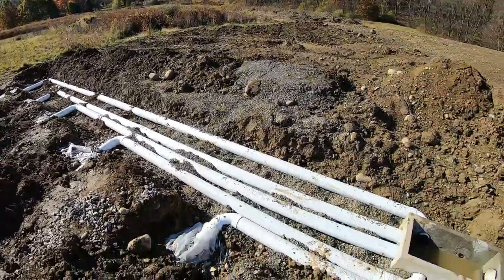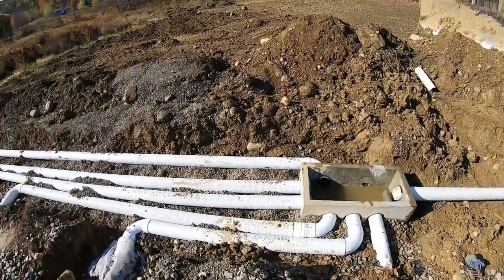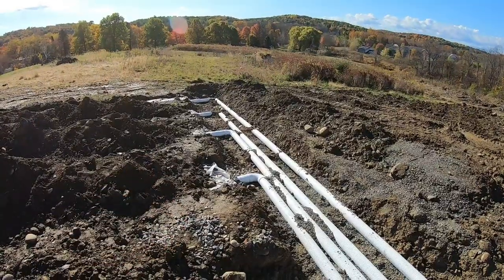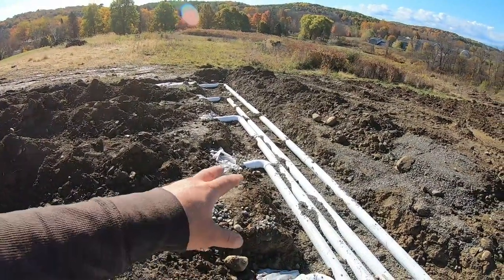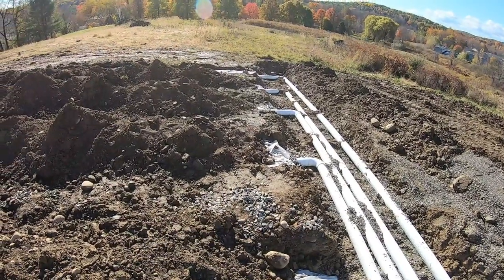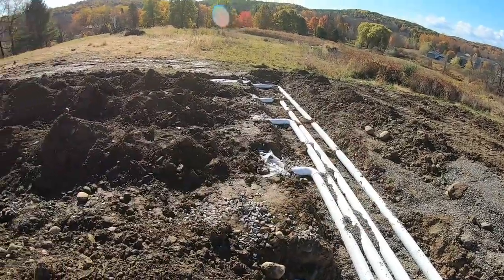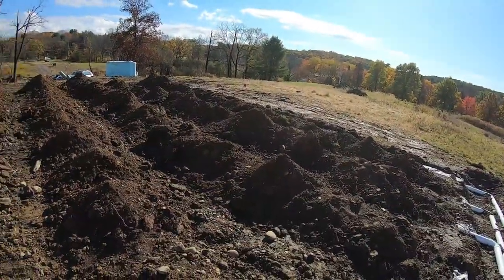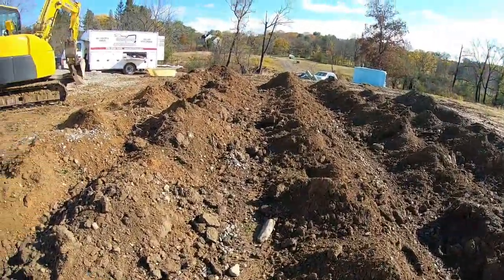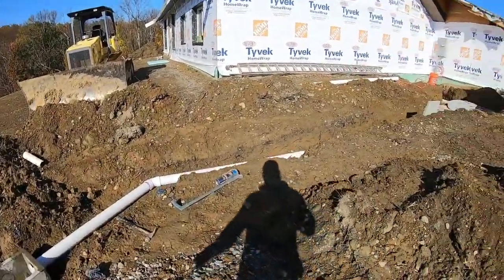And like I said, make sure your trunk's bedded all nice with some pea stone. Put a foot of stone under the tank. Your filter fabric, 6 inches of stone under it. Obviously, you've seen all that in the video. And your trenches, you want nice, healthy 2 foot wide, 2 foot deep trenches. Over here, they'll be 2 feet by the time we put the material from here over. And yeah, we got all this rain, so I'm gonna let it dry a little bit before I backfill, put the caps on the tanks, and this one's a wrap.